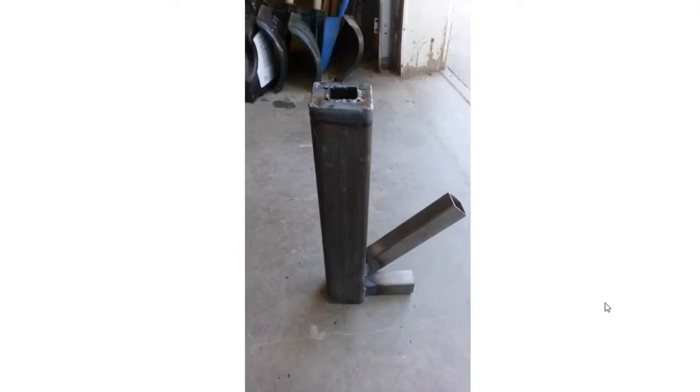This is what it looks like when it was put together. I left some air holes here because I figured that when it would heat up there would be some sort of liquid in here, and I would let the steam or the gas escape out of here. My first impulse was to use sand as an insulator. That way you put sand in, heat it up, let it steam out, and that would have worked fine. I happen to have the insulating fire brick mortar around, so I thought I'd try it, and it wasn't a good idea. Well, live and learn on that.